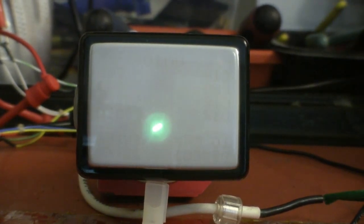So now in theory, when I turn the G1 bias more positive, it's currently about negative 50 volts, I will begin to turn that up towards 0 volts, and the beam should come on, and the audio function generators are already running. There we are. And so we have a nice bright spot on the screen.